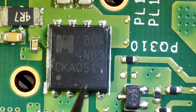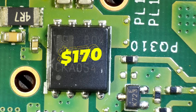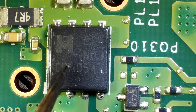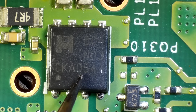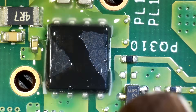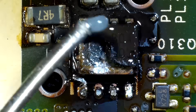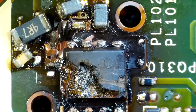Here is our new part. Unfortunately, I couldn't find the part to just buy online other than in a few places in China that looked like they were sold out and it would have taken forever to get here. So I had to buy a broken motherboard off of eBay, which is not ideal, but I want to get this thing fixed. This broken motherboard cost me about $170 and hopefully has the good parts that I need. It looks like this is the exact same part, so I'm going to be pulling it off of this board and installing it onto the other one. I'll be using my hot air soldering station to remove it and then also to remove the old broken one and install the working one.